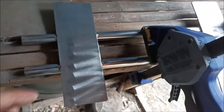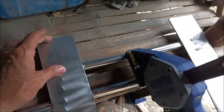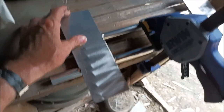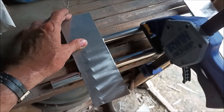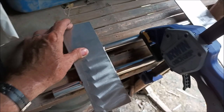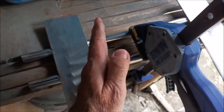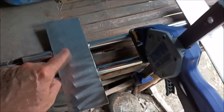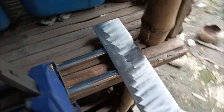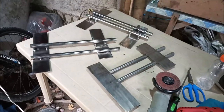The epoxy is mainly to fill the gaps because my two-by-fours are hand-cut lumber, so they're not all one and a half inches thick — they may be one and nine-sixteenths or one and seven-sixteenths. The side of the boat is flat plywood, so when you put it up one bracket is out here and one's in there, leaving gaps. That's why I'm filling in with epoxy behind here. It's got some texture and that's better than nothing.